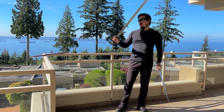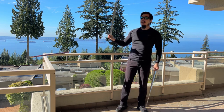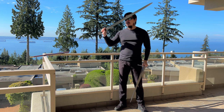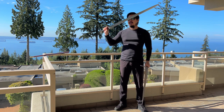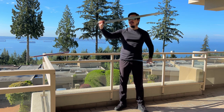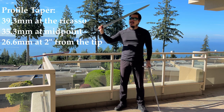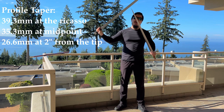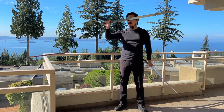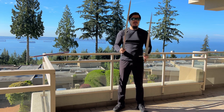And as you can see here, this type 19 arming sword is quite an outlier in that kind of development. Similar to earlier medieval swords, it has a blade that has very little profile taper. At a glance, you might think that these two edges are parallel, but actually they're not. There's a slight amount of profile taper, so at the point of percussion, the ideal cutting portion here, it still retains about 70% of the width of the base. Still, that's quite wide if you consider that.